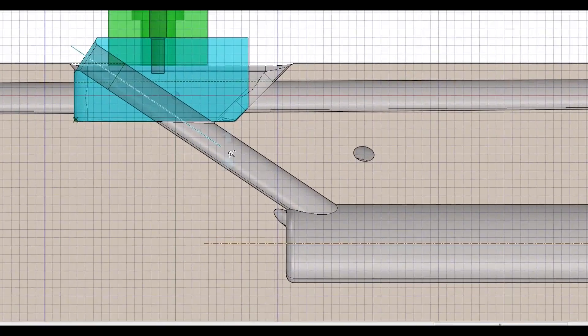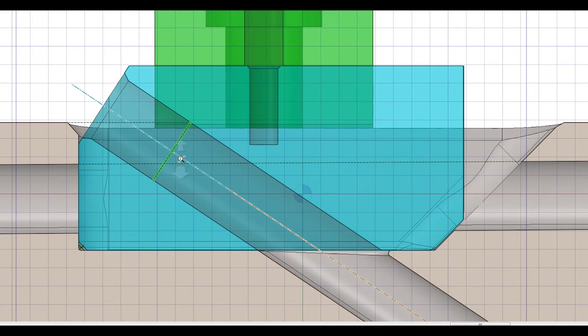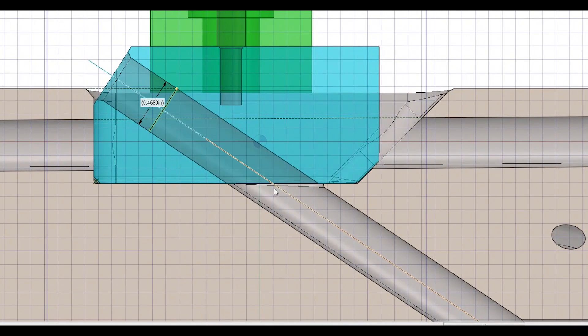Let me zoom in a little bit on the top of this area. You can see I've sketched in some hidden lines here - dotted lines. You can see if you put a spot face here that this line would break in. This other line represents the bottom - or the top - of this drilled hole that runs through here. So if you put this spot face in to get the full diameter of the hole to start with, you'd probably have to go just a little bit deeper than this, and you're already breaking into this hole. This is what caused the problem, because when the drill comes in it's cutting on the top and it's probably alright until it gets down to about this intersection point, but it's still got material to take off and it kind of pushes it down and misdirects the hole.